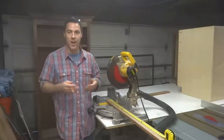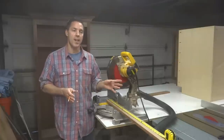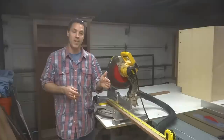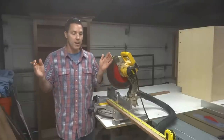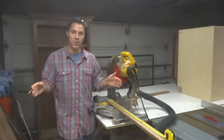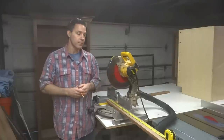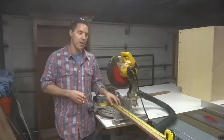Maybe nobody notices — that's just me. On the other side of that cabinet, I'll leave about a quarter of an inch of space between the face frame and the side panel of the box. So while the face frame will be 46 inches in width, the overall cabinet will be 45 and three quarters. So as I said, I'm going to start with the face frame.